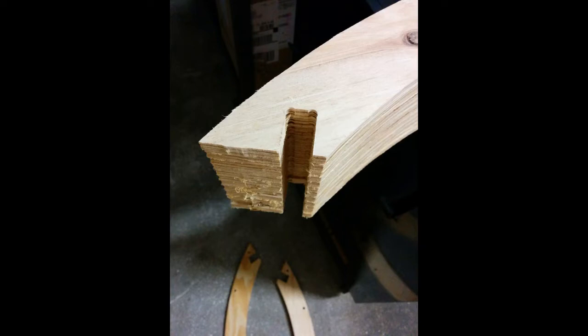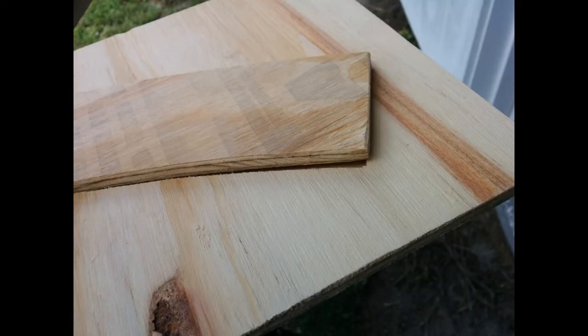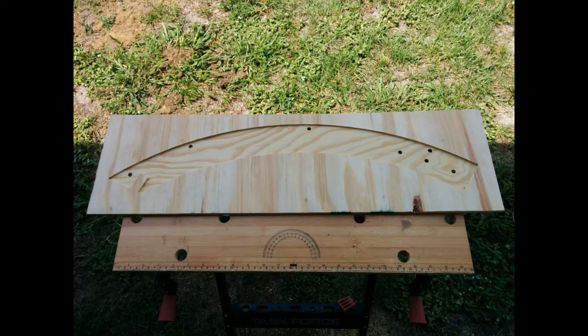When I modeled the hole drilling jig, I did not make it any larger than the part. I did sand the outsides of the parts down. Of note is that I cut the jig out vertically while the parts were cut out horizontally, and this difference in orientation may have caused some of the issues I had. Most of the parts didn't quite fit in the jig even after sanding, both because the parts were about 1-2mm too long and because the curve didn't quite line up. I was able to use each end of the jig individually to drill the holes I needed, but in the future I'll try to enlarge the outline of any jigs like this before cutting them out, and cut the jig in the same orientation as the part.